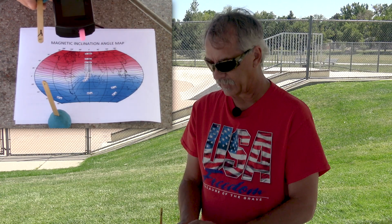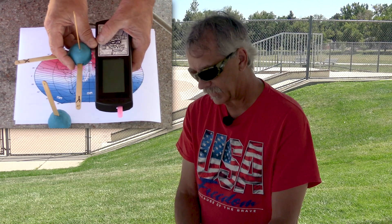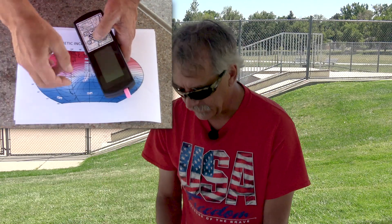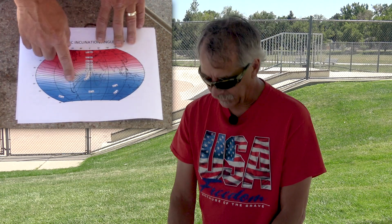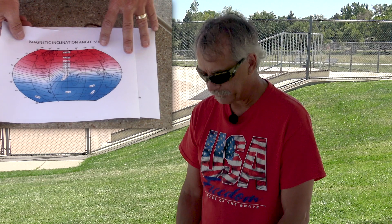The compass in this device is a three-axis compass, with X, Y, and Z aligned with the faces of the circuit board inside the flat box. The three axes we need to find maximums and minimums for correspond to the top, bottom, and four sides of the box. All we have to do to calibrate this is align these faces with the magnetic field. You don't really have to spin it all over, but if you do, the device will find those points automatically. Really, all you need to do is tip the faces to where the magnetic field is — it comes in from the south and goes into the north at roughly a 60-degree angle across the United States.